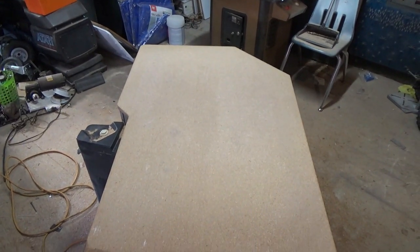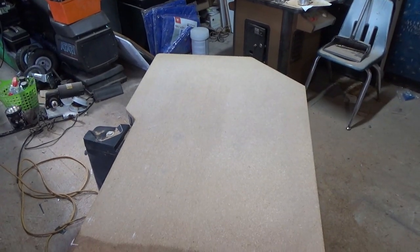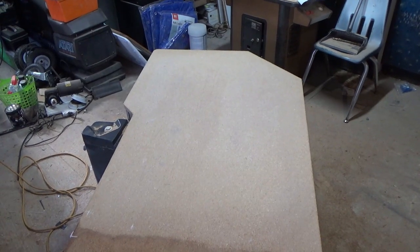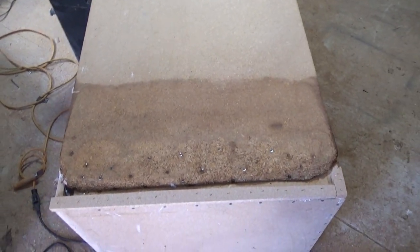Okay, the entire cabinet has been belt sanded. Now there are some stragglers with the side art, like right here. A few little spots like that all over the place. That's totally okay. Remember, I hit this with a coarse grit paper. We're gonna go over it with finer stuff, so all those little things will be picked up. Now I did this.